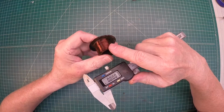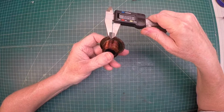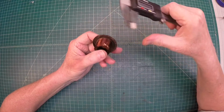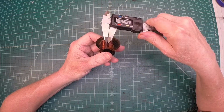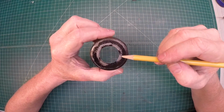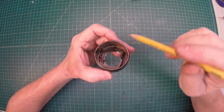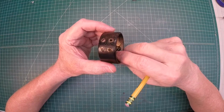Knowing the field coil is not repairable, let's just go ahead and wind a new coil. I had checked the other day. It looks like the wire gauge in the field coil itself was probably 40 AWG. Here's the existing metal enclosure that the old coil resided in, and there's some rust inside. I'll take some time and get this de-rusted.